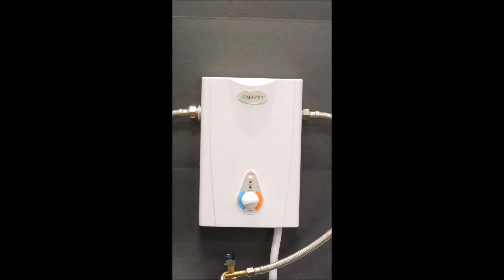The lights indicate the power sent from the elements. The slower they blink the less power is being demanded of the heater; the faster they blink the more power. Adjust between the 28 amp setting and the max setting and you can see what I mean. Always test the water to prevent scalds and enjoy endless hot water.